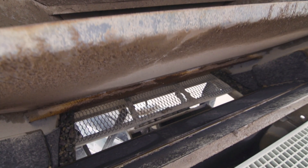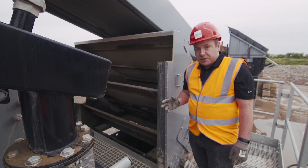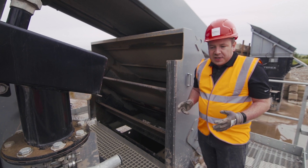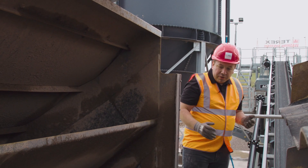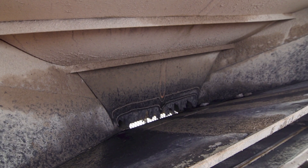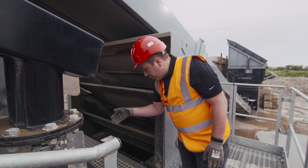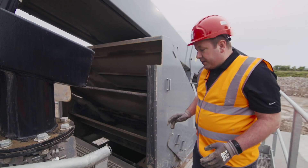We've just turned off the machine for a few moments to explain more about the 20x6 screen box on this AquaSand. The 20x6 screen box is a proven, high-performance screen box — we fit polyurethane media in each deck and, as explained, your aggregates are split into three sizes and make their way down to this rolling chute, which is one of the best features on the machine. In normal mode the oversized material goes over the top of the chute, the middle deck overs go over the middle part, and the bottom deck overs go down into the bottom chute out to the three conveyors.